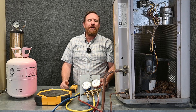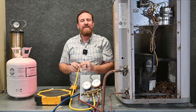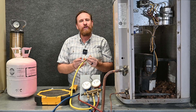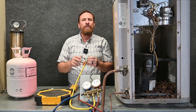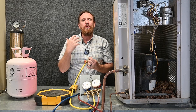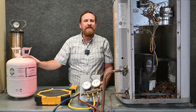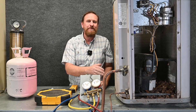It sounds like a lot of steps and can be overwhelming, but with manual low-loss fittings I have more control — I can purge in the opposite direction with this valve, purge at my tank with vapor only instead of worrying about purging with liquid refrigerant, and actually purge through my manifold gauge set. There are really a hundred different ways you can use these manual low-loss valves. They give you more control and allow refrigerant to flow faster because they're less restrictive than automatic low-loss fittings. New students can get overwhelmed, but you need to know how to work with them. However your lead wants the hoses installed is how you should do it, but eventually you'll be in your own truck, and it still comes down to the basics: take the refrigerant out of the tank without fractionation, make sure your hoses are purged so there's no contamination, and throttle it into the suction side on a running system so we don't damage the compressor.